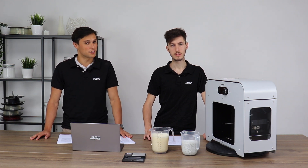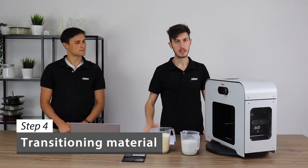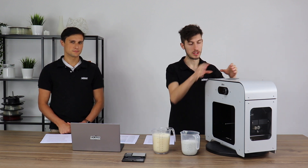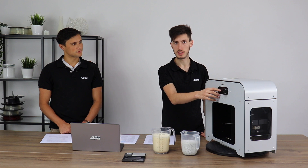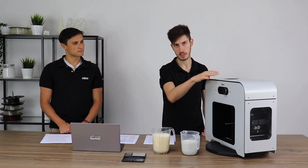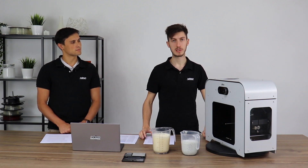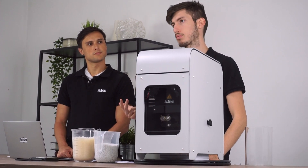Keep in mind that from the very first time you're using your machine, the barrel will never be empty again — there's always going to be plastic inside. To push that plastic out, you need an input. Call the plastic inside A and the new plastic B: you need to make sure the process settings you're using can melt both plastics completely for a safe and smooth transition. Good transitioning materials include HDPE, DevoClean Mid Temp, and DevoClean High Temp, which 3DEVO provides.